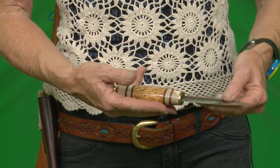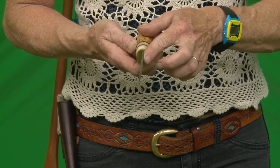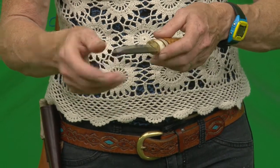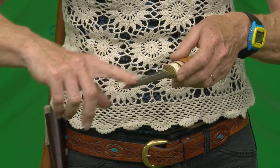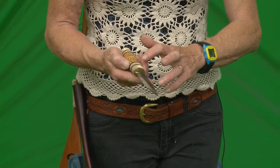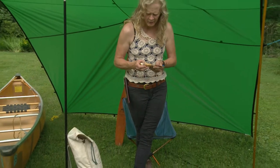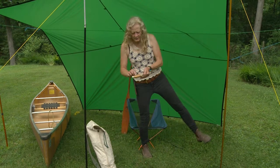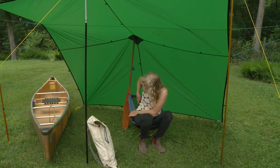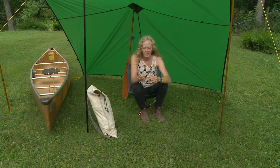It's a beautiful knife. It's A2 steel. It says 1/8 tang thickness, but I think it's really like 3/16, acid etched, Scandi grind, and I'm not sure what the bevel is, but I think it's like a little secondary grind, but I've sort of been removing that as I go. It's got antler, I think it's caribou, I'm not sure. Caribou antler, leather, and it says curly birch, but it almost looks like bird's eye. It's got a stick tang, and it's threaded at the butt with brass.